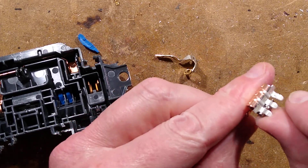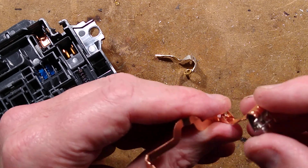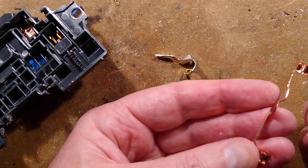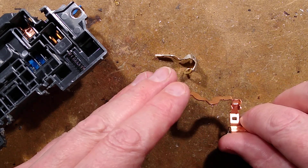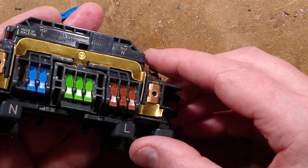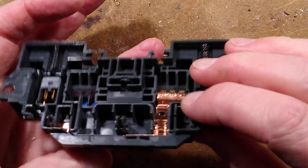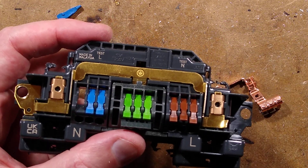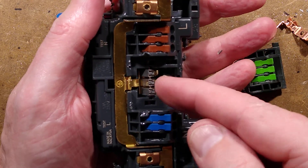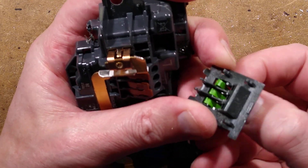These little fingers here are the bus bars. And when you press it down, it releases that metal spring down to let you get the wire in, then grips it back so that it can't be pulled out. It looks pretty solid — very acceptable. These are all paired together, that's where it's seeing all the current flowing through the circuit, but all it's seeing here is the supply to the local socket. Although these are rated 13 amps, they usually say maximum current per socket — it doesn't do the full 13 amps. I want to get that out. Interesting construction — I was wondering how they'd got that small insert in there to go down and then spread out three terminals. It turns out there's a separate module that clips on from above with little cantilevers, hinging down to actually push those things open.